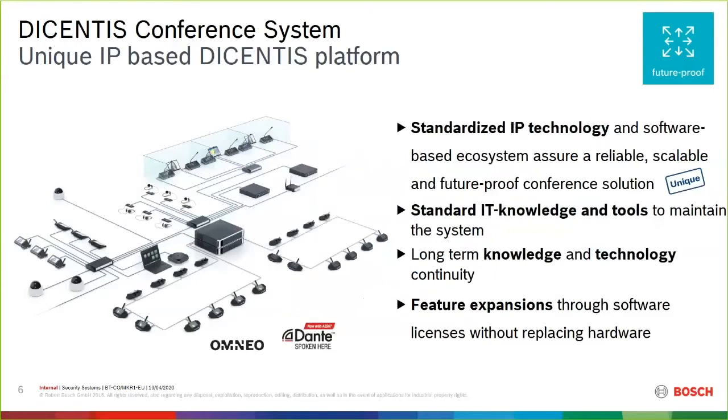It is truly an IP-based system. I don't think anyone else is doing a 100% IP-based system, and that is kind of the future-proof element. I don't think networking and IP is going anywhere — Cat5, Cat6 aren't going away anytime soon. We are running a gigabit switch on every device. In its most basic form, every single device has two RJ45 jacks that are gigabit ports. Whether this goes on a corporate network, a corporate VLAN, or a private network, every device we connect is a network device.